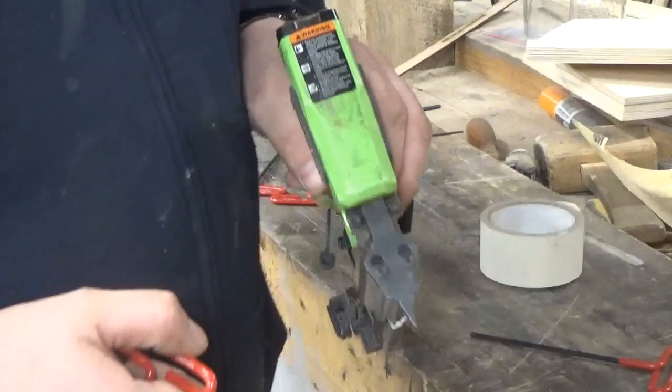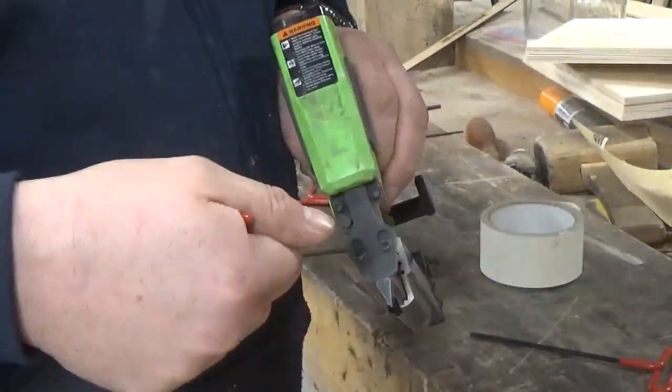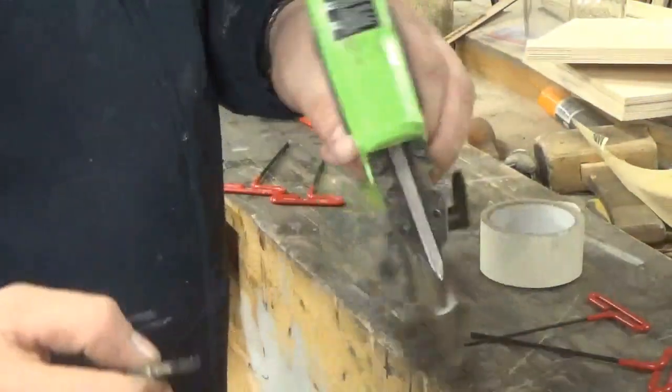You're going to need a 3mm Allen wrench, a 4mm Allen wrench, and a 2.5mm wrench. I'm so used to working in standard measurements, it's crazy. Now in the front we got these two little screws in the hammer here. Take them out. This piece clears off the front.